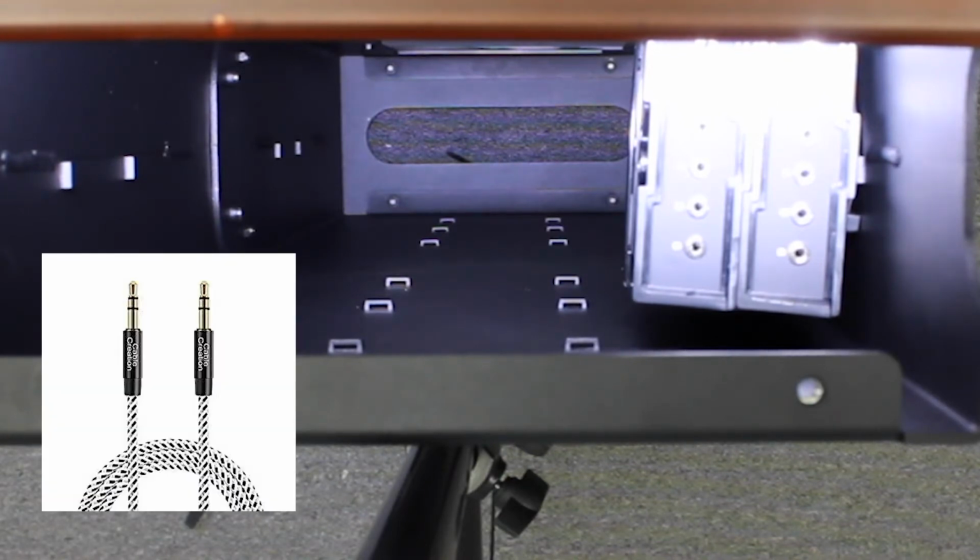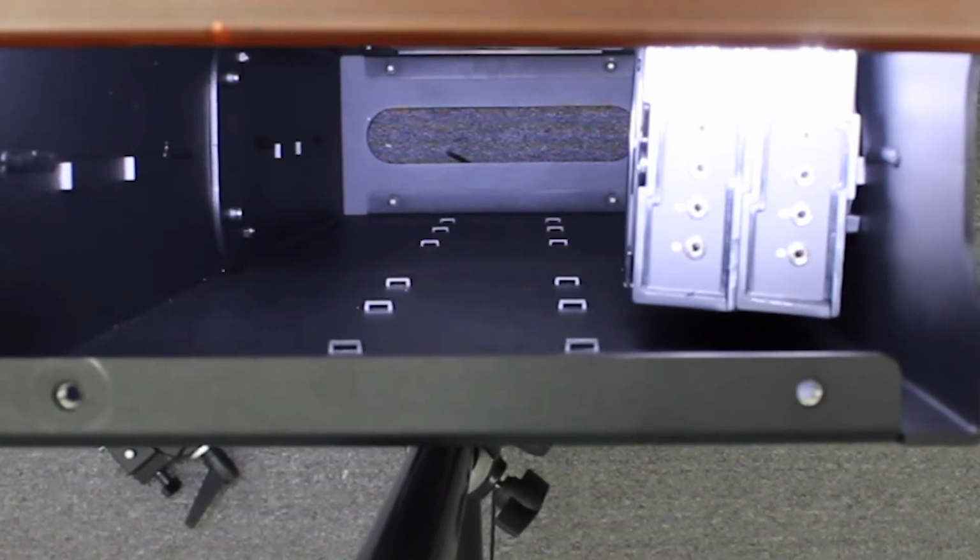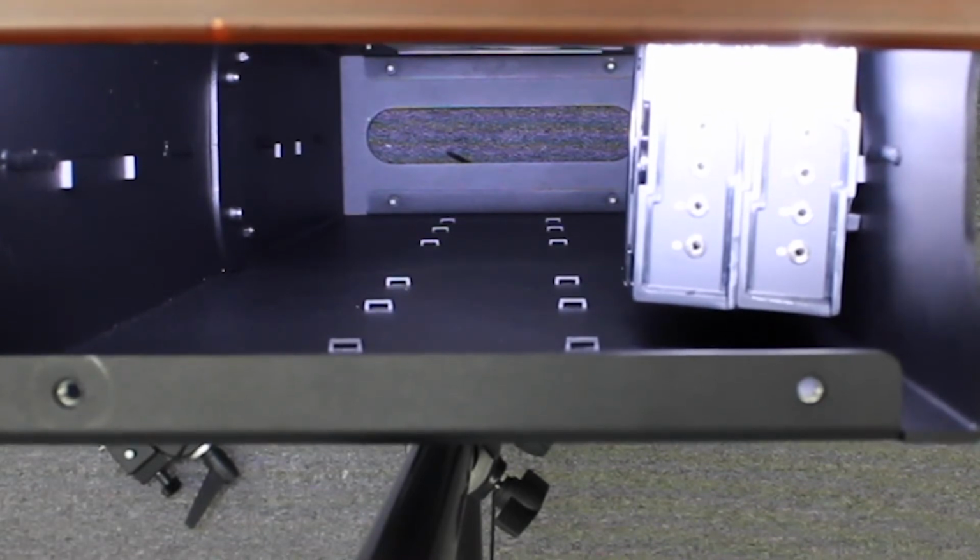And then on the second Esper box, you're going to use ports 2 and 3 to finish off the syncs to the cameras, and then port 1 is going to be used in order to daisy chain the two Esper boxes together. So it's going to go into the input port of the first Esper box, which is the one touching the left side of the booth, and then it's going to go into port 1 of the second Esper box. That's again a 3.5 millimeter to 3.5 millimeter end aux cord.